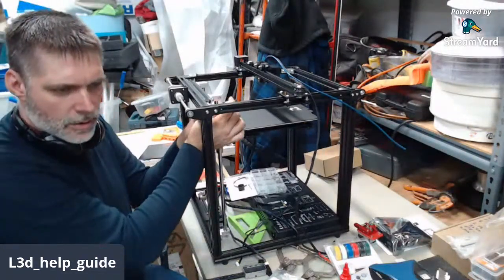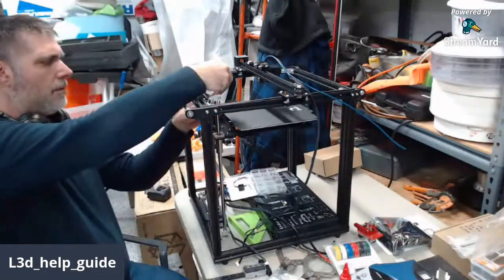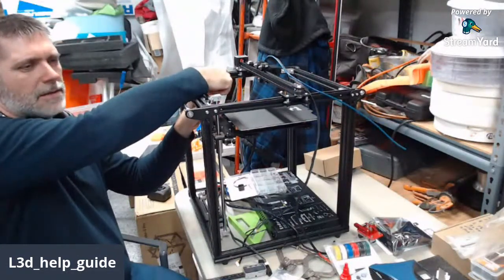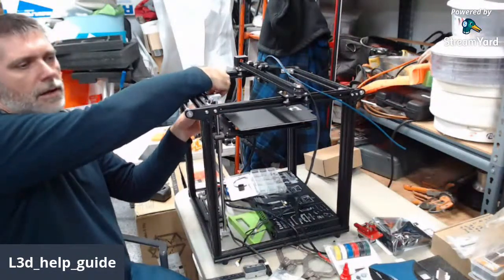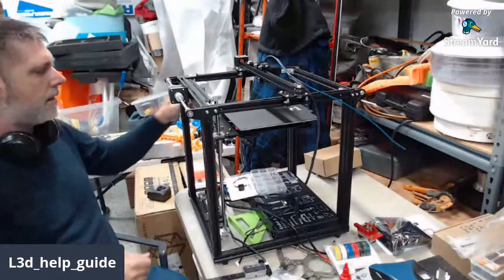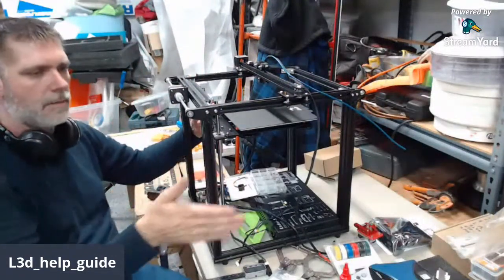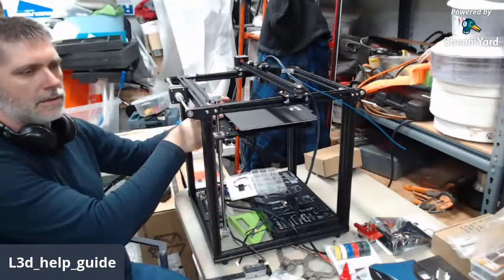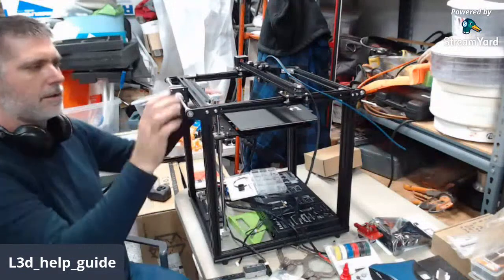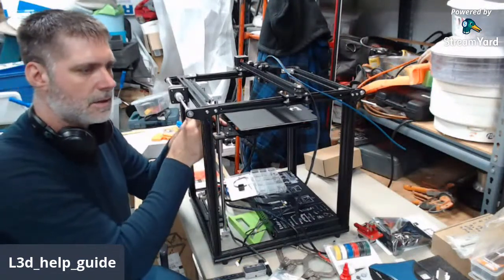Should you buy the Core XY conversion for the Ender 3 or get an Ender 5? So I've had some non-Creality Core XYs in the background, and they can let you go a little bit faster than these Cartesian cubes, but for all the headaches it takes of balancing the belt tension. What nobody tells you in the dirty little details of Core XY is if the belt tension from this side of the drive to that side of the drive is out of balance, it will actually make your circles oblong. And well, I'm pretty good at tuning and I can get around that, but I don't want to have to. And also, some of them are not putting really quality components at the pivot points. So as your bearings wear, your belt tensions can change and introduce artifacts that you don't want.